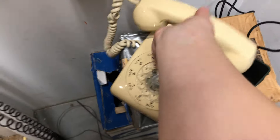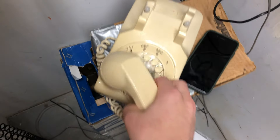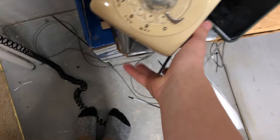With the ATA, the rotary phone's extension is 35 — so if I dial 3-5 it works, takes a second because it's analog. And if you dial 33 that's the other extension. Pretty cool. Now let's test the emergency lights — there's that emergency light powered by that pack. If you turn the breaker off, the pack comes on and the remote heads come on. Pretty cool.